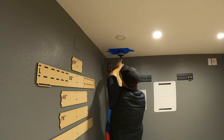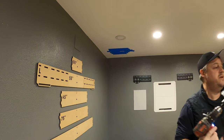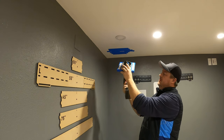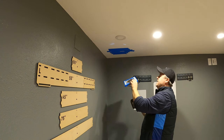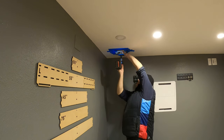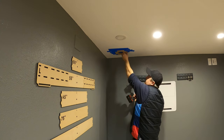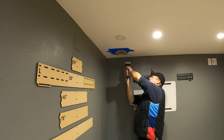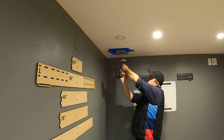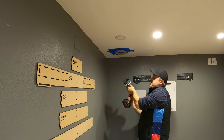I'm going to do a light hole — remember, it's drywall, and if it was wood, there's just a little bit of dust. I've just barely touched it and now I've got a center hole. I take my template and it fits right in there — just pops in. Now I can take my hole and pop that up there, and I have a perfectly double-backed wood template. If this thing were to walk across the ceiling, it would just destroy the ceiling — that could cost thousands or tens of thousands of dollars in damage. I've already done a little tiny mark to indicate my half oval, and I've got a center mark. Chuck it real tight because you're going to run this in reverse on the wood almost until the wood feels like it's burning, then spin it forward.